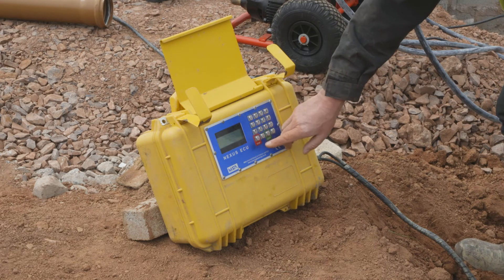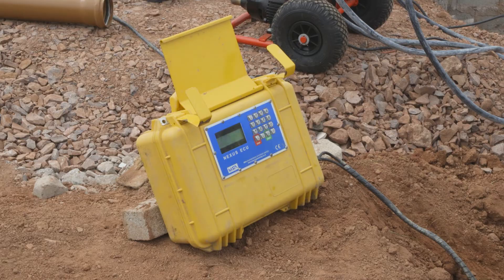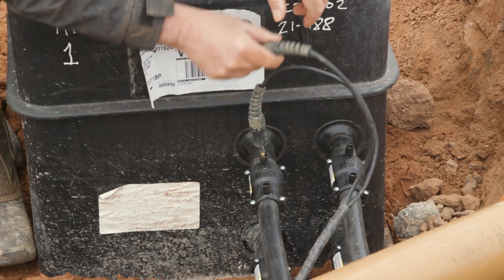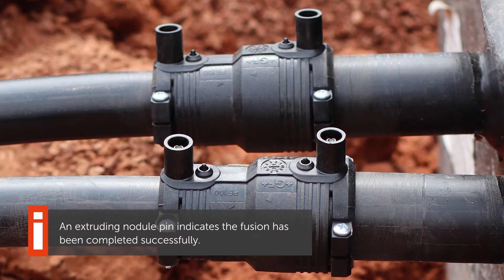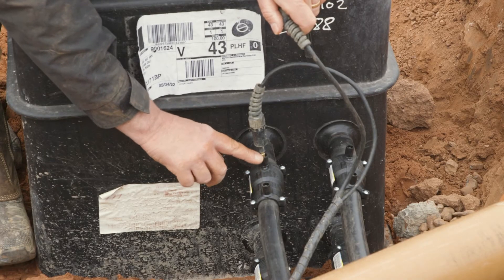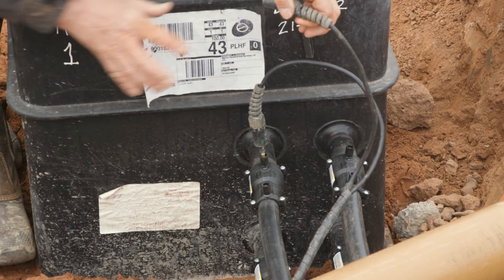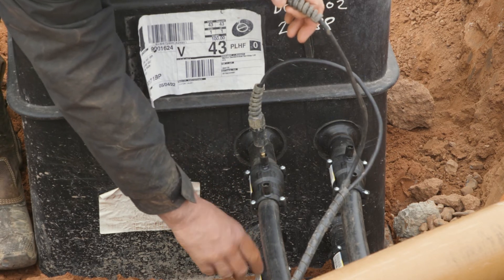The machine starts beeping, telling me to press stop, so we stop the power going to that fitting. I remove the two probes and put them onto the next connection. Let's have a closer look at this last connection — you can see down here there are two little nodules that are very flat at the moment. When the fitting is cooked and the joint is complete, those nodules pop up about three or four millimetres into a sharp little spike. So if you're not sure whether you've done a joint when you've got multiple fittings, just run your finger around to make sure they've definitely been cooked.